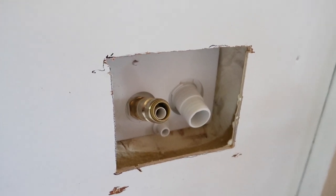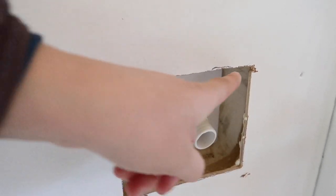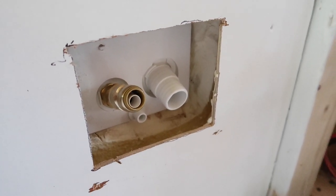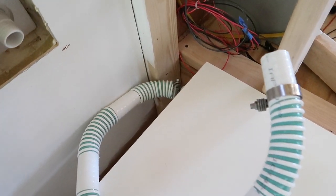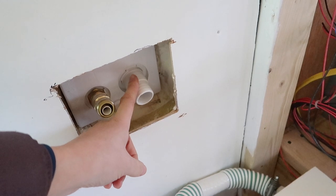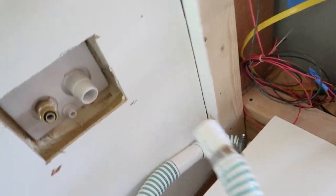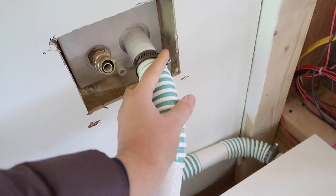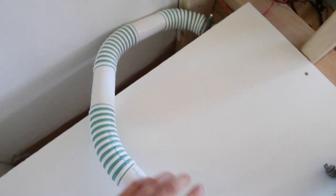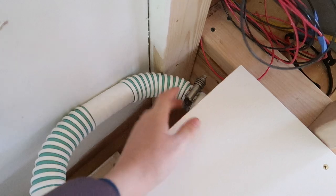Here is the water inlet from the inside. As you can see, it sits pretty far into our wall. Once we hook up the hose and pipes that are going to hook up to this, we will fill in these gaps with some Great Stuff so it's nice and insulated — but it fits nice and snug. This is the hose we are using for our gravity fill line — it is a one and three eighths inch inner diameter hose. This fitting is actually a one and a quarter inch fitting supposedly; however, we ordered a one and a quarter inch hose and it did not fit over this. So we moved up to the one and three eighths inch and it fits on a little loosely, but we're going to tighten this hose clamp nice and snug and monitor for leaking. We've also got a hose clamp clamped around the entrance to the tank.